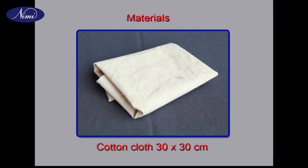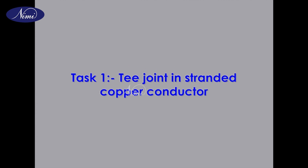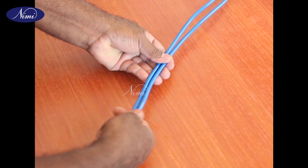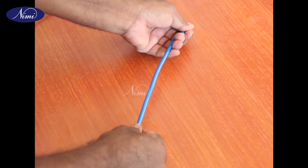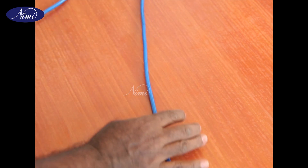Two pieces, cotton cloth, sandpaper smooth. Task 1: T-joint in stranded copper conductor. Step 1: Collect two pieces of PVC insulated stranded copper cable 7 by 0.91. Indicate one piece as through cable and the other one as tap cable.